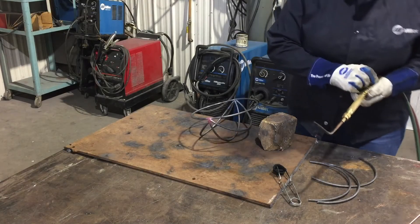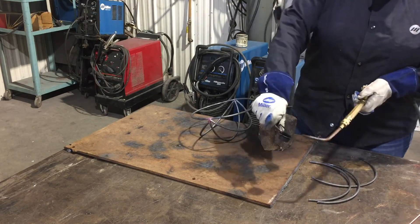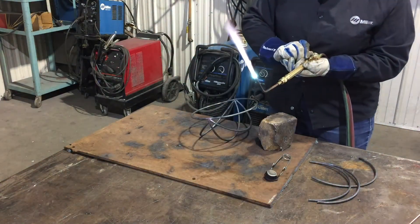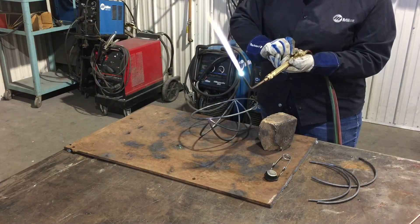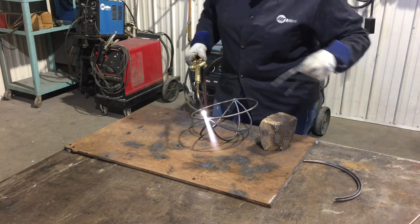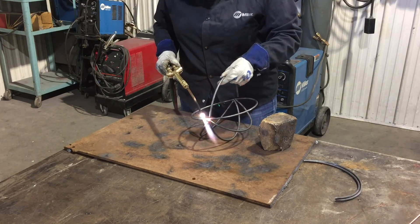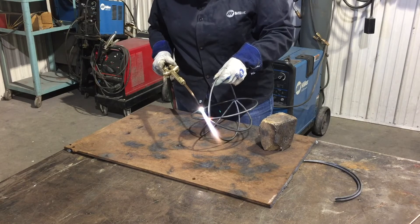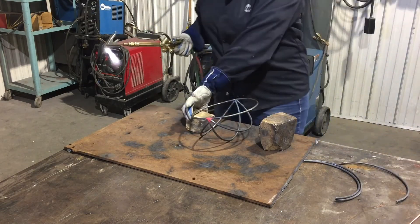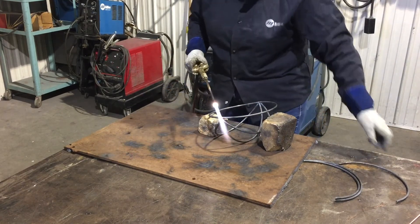To do the second half of the sphere you'll basically repeat what you did with the first. You can work off spots that are already hot — those welds I just did are pretty hot, I can get them cherry red again. I can place my first spoke, tack weld it, second spoke, third spoke, all the way down the line. If you need help, you can prop it up with another fire brick to get a better angle. Just rinse and repeat until you have a fully solid weld on each side of your sphere.